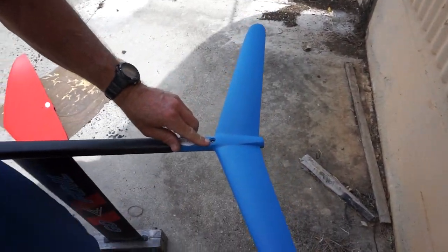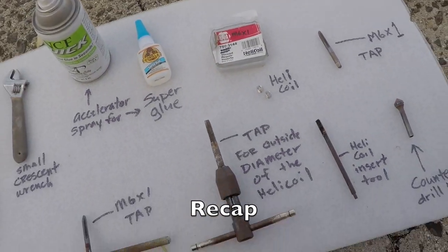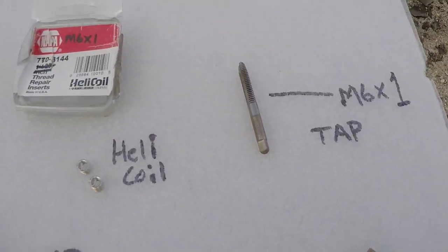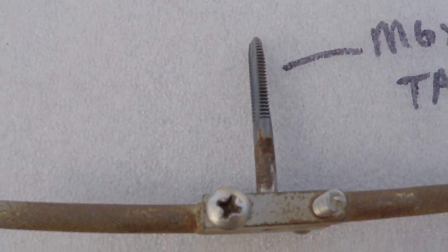Remember, you tap your tail right like that — see how it all lines up perfectly. Put your screw in there. See, this is how your screws are supposed to go in. If you can do it by hand, it's perfect — and that's how you're supposed to do it. We're going to explain this all in detail — it's a pretty easy process. It sounds complicated right now, but you'll see that it's very easy. You just need the right tools. The main tool is the tap that goes for the outside diameter of the helicoil. Then you need your insert tool — this will grab your helicoil and put it inside your fuselage. Put a little super glue inside the hole of the fuselage before you put this in. Then you back out your tool, knock off the tang with your round file or any small metal piece that fits inside the hole. Then run your tap through using a tap adapter handle — boom, you're ready to go.